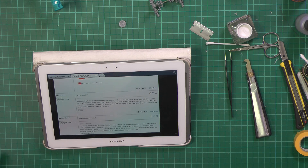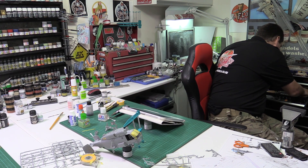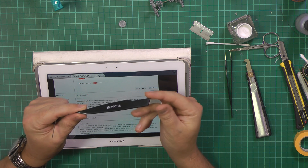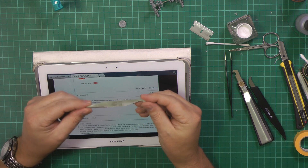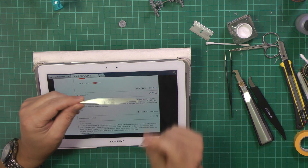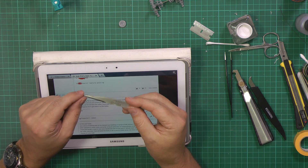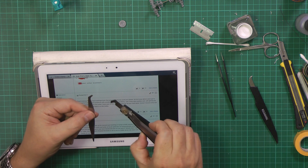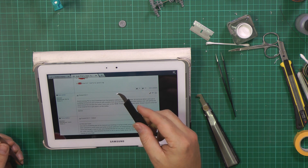I have a couple of other things in my arsenal - scribing tools. These are my other go-to ones. Cheap but very handy is the Trumpeter one - it's a very fine blade, finer than the traditional p-cutter, really really nice. My other one which I use quite a lot these days is the UMM scriber. It's not as refined and delicate but as a general get-in-there tool it's really nice. It's also got a straight blade which is handy for round edges. The big difference is this one you can push or pull, whereas the p-cutter is really just a pull stroke.